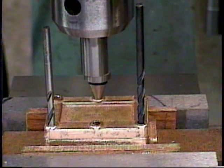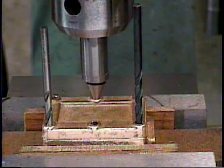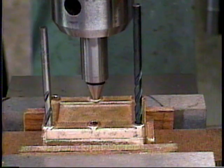Now using number 29 drills to pin both mounting holes number 1 and number 2, I'm using my conical edge finder to locate where to drill hole number 3, and see how I can tell when it's lined up, because it will look like one piece and it will also feel like one piece when I get there. So that's how I locate where to drill mounting hole number 3.